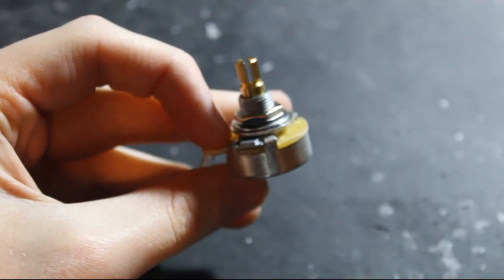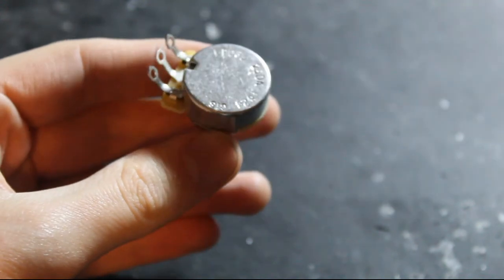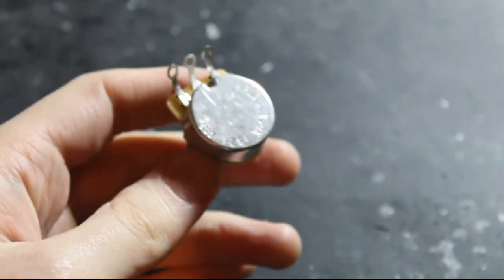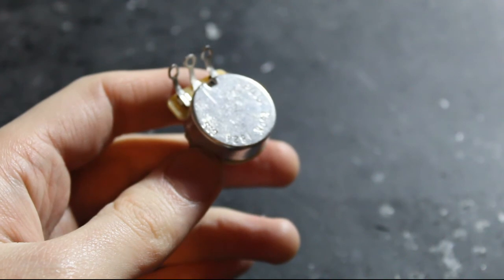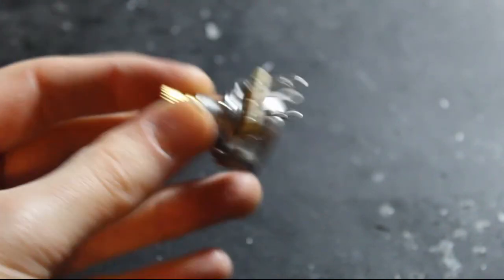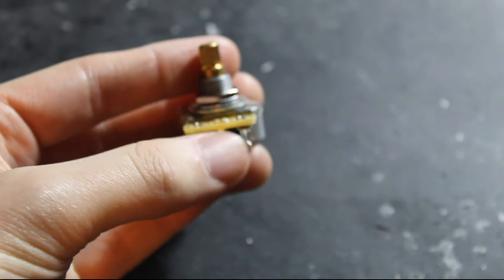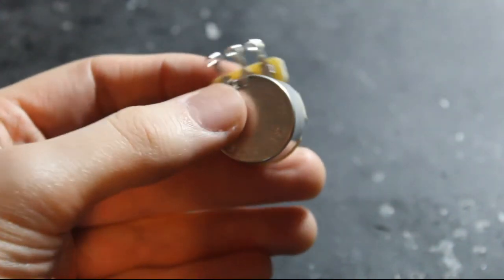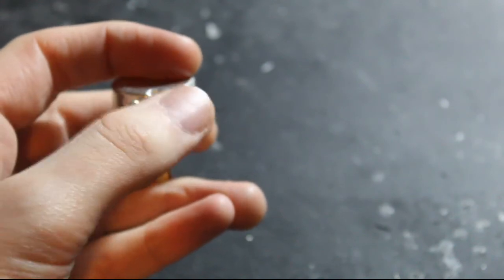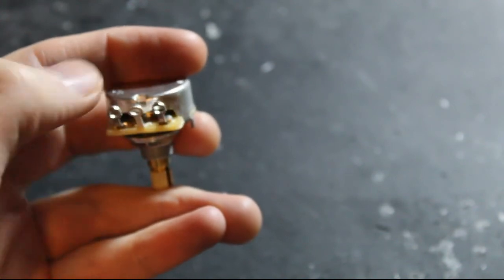Finally, we have potentiometers. If you remember back to your science classes, the way we use resistance — or the way we see it — is we can imagine charge is water, and the resistance shown in the circuit is like pipes. The larger the resistance, the smaller the pipe, which means the electrons have a harder way through it. Potentiometers essentially present two pipes, and these are inversely proportional. This, for instance, is a 250k pot, which means the resistance between this lug and this lug is always going to be 250k. But the resistance between the middle lug and each outer lug can vary.